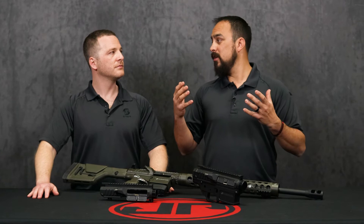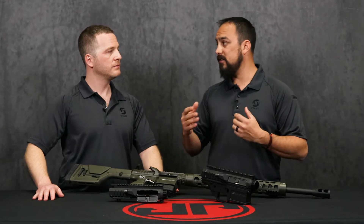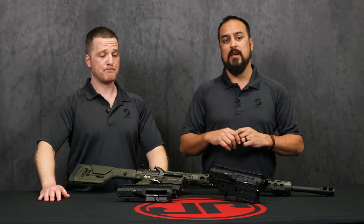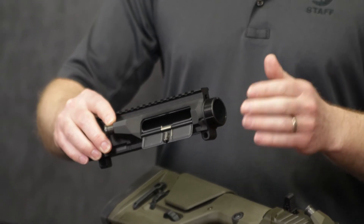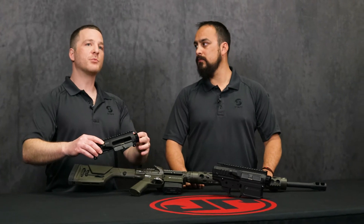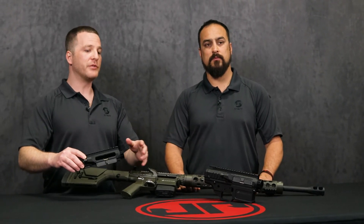I agree. These sets are really cool, especially for the home builders. There are a lot of guys at home who want to build their own rifle. Before, if you wanted to buy one of our uppers, you pretty much had to buy our lower receiver because of the side charger. So this kit takes care of that. Now, one thing with the LTC 19 as well as the PSC 19 is the inner diameter — the receiver extension where the barrel extension goes in — it's a slightly smaller inside diameter. We're going to have a video on our ProPost, so make sure to check it out. It's going to talk about the thermal fitting process. You can now do that thermal fitting process at home.